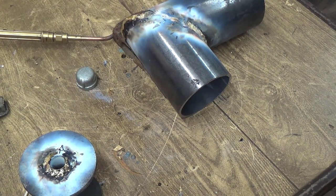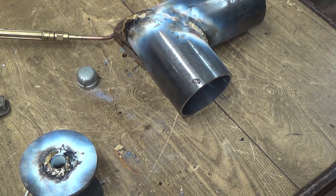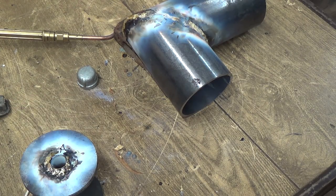warm. So, and then around here, where we're MIG welding this on, we'll just weld those on the outside too. I think that'd be all right. MIG welds are all right, but this is a little bit nicer because you can get the stuff to kind of flow a bit, if you know what I mean. But I don't think I've got enough rods left to braze these all together. So I guess that's about as far as I can get today with that. Anyways, it's a good start.